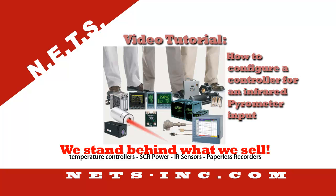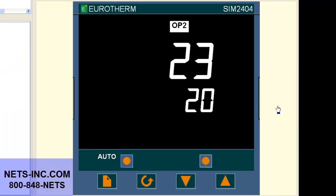My controller input is not a thermocouple, but an infrared pyrometer with a linear output signal of 4 to 20 milliamp DC. How can I configure my controller for this type of input? This video tutorial will show you how to change the input from a thermocouple to a linear milliamp input on a Eurotherm 2400 series controller.